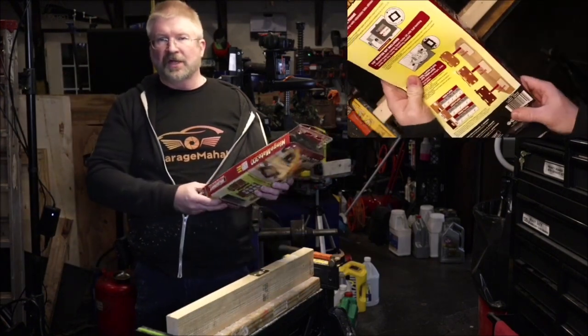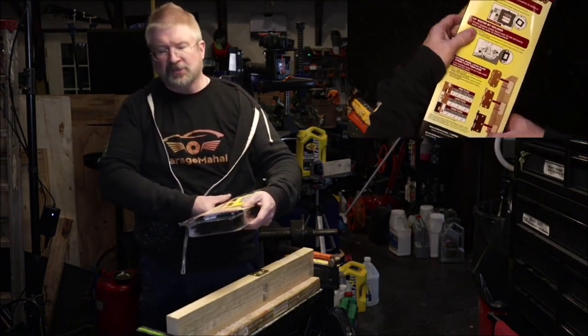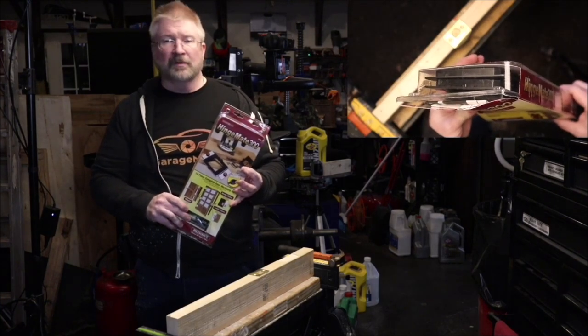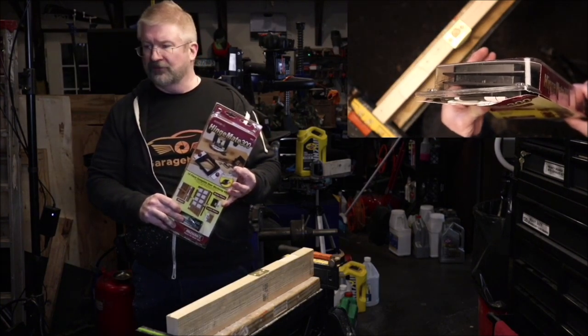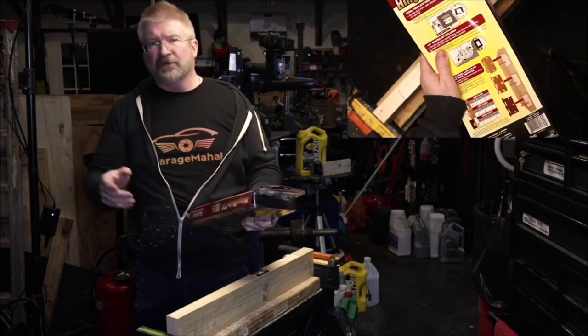You drill down only as deep as necessary, and then when we flip this door latch over it will sit nice and down in there. You may have to drill this hole a little bigger depending on how deep your door lock actually goes. I hope that gives you a really good idea on how you use this Miles Craft HingeMate 300 — what a great kit. This will get your jobs looking absolutely perfect and masterful. Anyway, Brian from GarageMall, thanks for watching and be safe out there.